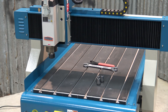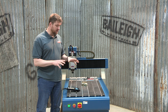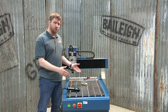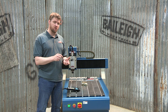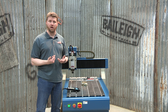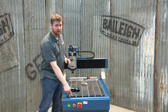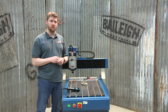At this point we'd be ready to put material on the table and set our origin point for our cut file. We've moved the gantry back out of the way using our controller. Now we want to set this table up for the actual cutting operation. The first thing we want to do is get a solid piece of wood on this table to use as our sacrificial board — basically a board that will get witness marks from the tool as it cuts our good material, which will lay on top. This board is a consumable item that will wear out over time, but it protects the extruded bed. We'll clamp it down with our T-slot clamps and get it in position.